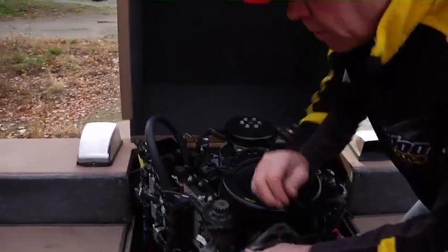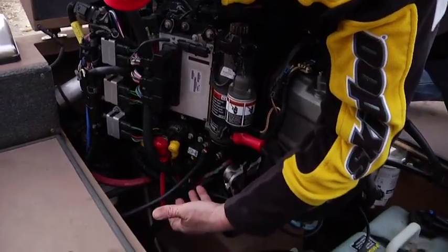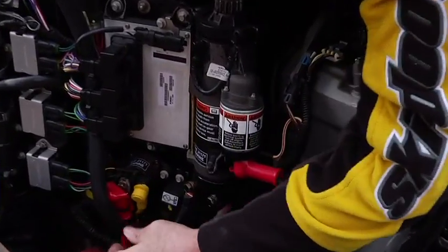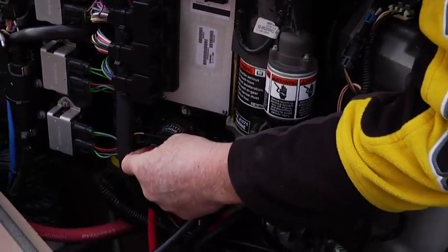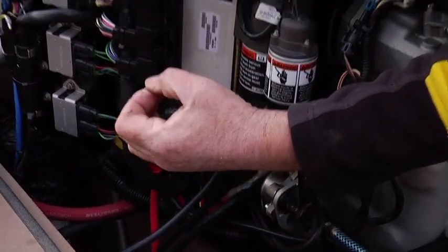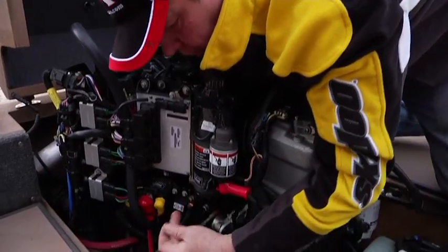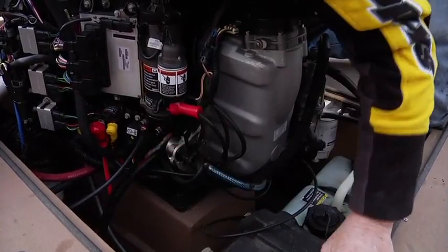On the opposite side of the motor, mostly your electronics, your starter motor, your starter solenoid, your fuses, relays. The electronic portion of this engine has been bulletproof. The things you can check occasionally is make sure you have a good connection. Don't snap it, don't get brutal, but check your solenoid, red solenoid wire, because especially on a direct injected engine, if you have a loose cable or a loose ground, it can create running issues, and you'll track down everything else and then find out it was just a loose cable. So check that, check your grounds occasionally. Just make sure your wires are not loose when you wiggle them with your hand, and that's really all you have to check occasionally.